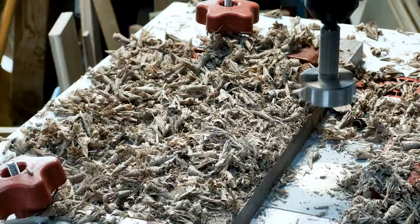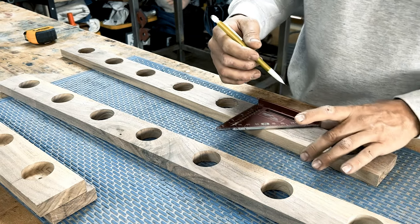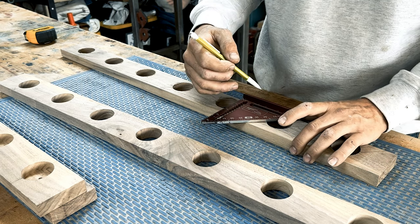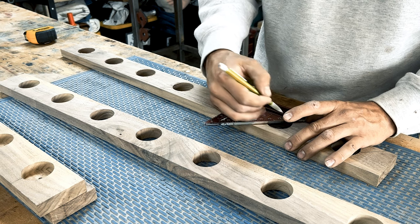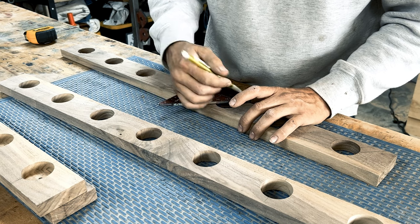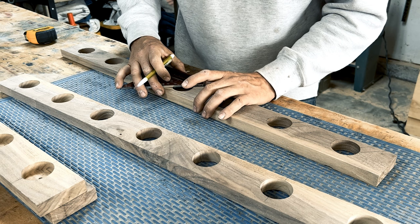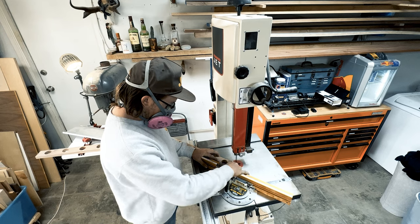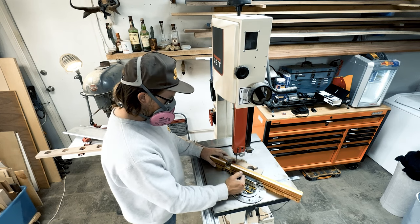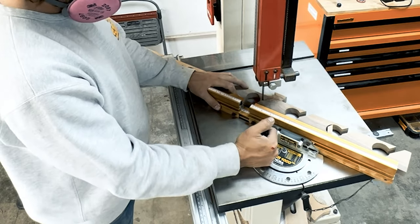For the second piece, we're gonna mark out the lines for the bandsaw. Since you're using a seven-inch speed square, the diagonal side reads in degrees. I make my first line at 12 degrees where it meets up with the edge of my circle, and the second at 5 degrees where it meets up with the lower section of my circle. This will give you a half-inch cut out of each one of your seven holes. Head over to the bandsaw, set your miter gauge to 45 degrees, and cut directly on each line that you just made.